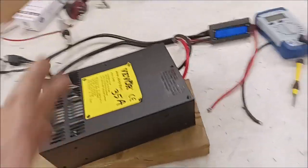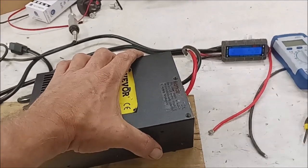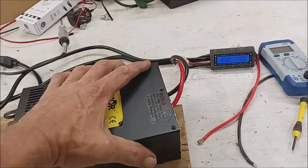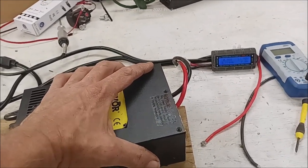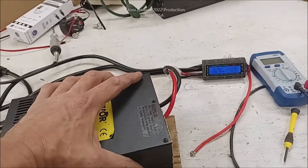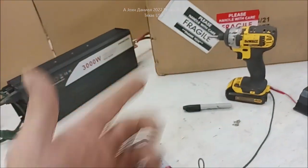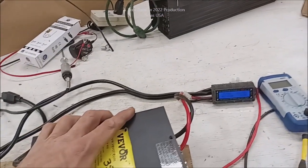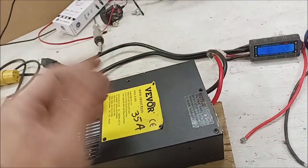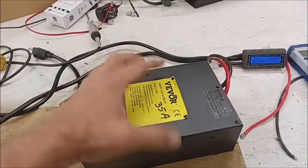All them batteries out there cost me about $3,700. To buy one quarter of those batteries in lithium right here would cost me $4,000. So I am saving 60 cents on the dollar doing this. And the truth of the matter is, if you can keep lead acid at above 50% depth of discharge, you can literally add 50 to 60% lifespan to them. So I'll have 8 and 10 year lead acid batteries — just like lithium claims to be — and I'll have saved about $7,000 cash, which allows me to put in more solar, buy more toys.